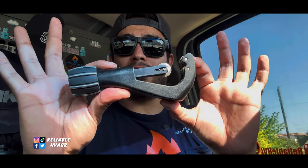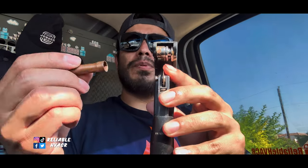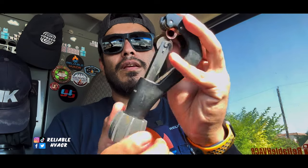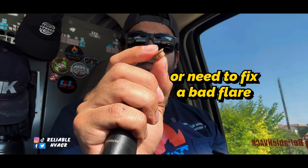The big tube cutters — a lot of us have the silver one with the blue handle — you can see there's a gap right there. You put your flare in that gap, tighten it, and it fits in there perfectly. This one is spring-loaded, so you get it on there and it comes off right. There is your flare cut off right at the end. So if you screw up or forget the nut, you can cut off just the end — hope that helps.